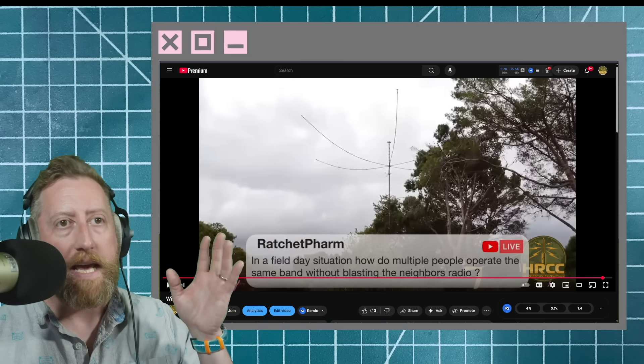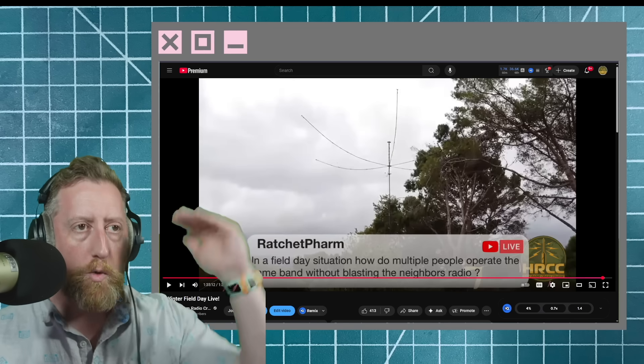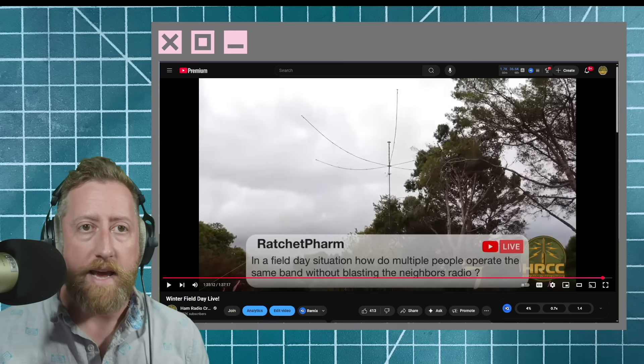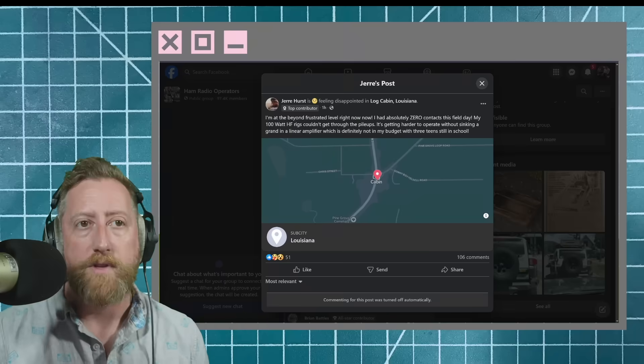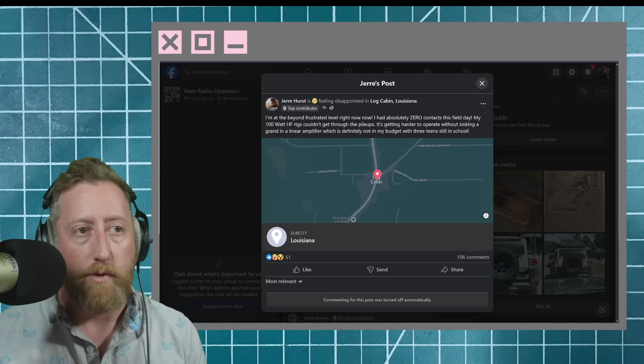On field day, you'll see a lot of antennas that have gain. Here's a hex beam with elements strung for most of 20 meters and higher frequency bands through 10 meters, and I believe 6 meters too. It's a fantastic resonant antenna that provides a little bit of gain — better than the Comet in most cases. If you want convenience you may accept compromised; hamsticks might even outperform the Comet. But if you truly want to break pileups, you need something resonant — a long wire, an inverted-V, an end-fed half-wave — all will outperform compromised antennas.